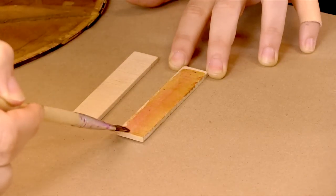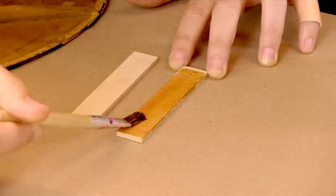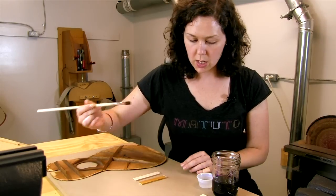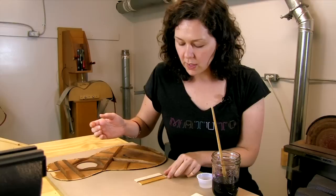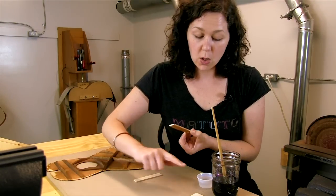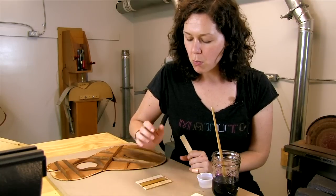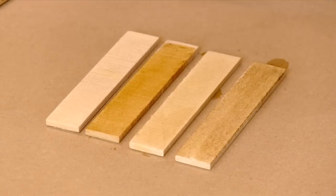You can see as I paint it, the color is turning from this really intense magenta sort of violet into this brown, getting closer to the color of the natural patina of the inside of this turn-of-the-century guitar. To avoid cupping, wet the opposite side as well, so any swelling that's going to happen on one side also happens on the other side — it's a fantastic little trick. This is one coat of a more dilute potassium permanganate, and this is two coats as it's dry.